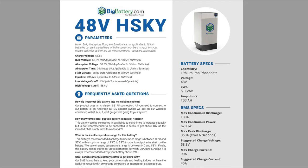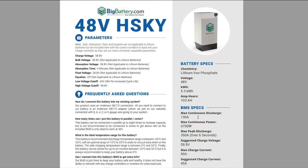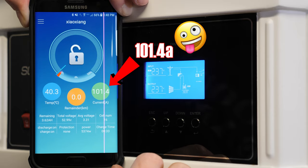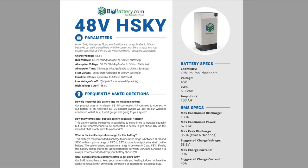A quick rundown from the spec sheet: this is a 48 volt 103 amp hour lithium iron phosphate maintenance-free battery. Maintenance free means you just charge it and use it — no watering, nothing. The BMS inside takes care of everything. It's got an advanced smart BMS with Bluetooth inside, though they don't advertise that yet because the app isn't ready. You can discharge at 130 amps continuously and up to 350 amps for a short time to start big loads. Recommended charge rate is 45 amps for longer lifespan, but the max charge rate is 90 amps — I actually went up to around 96 and it handled it great. Voltage range is 43 volts low cutoff and 58.8 volts charge voltage.